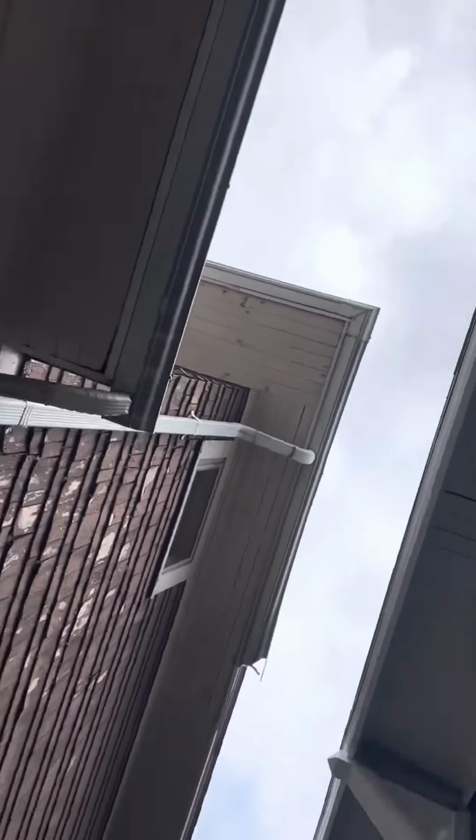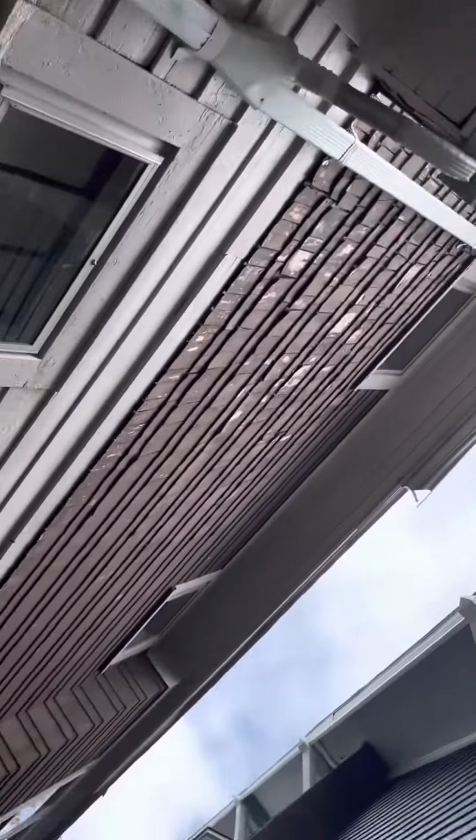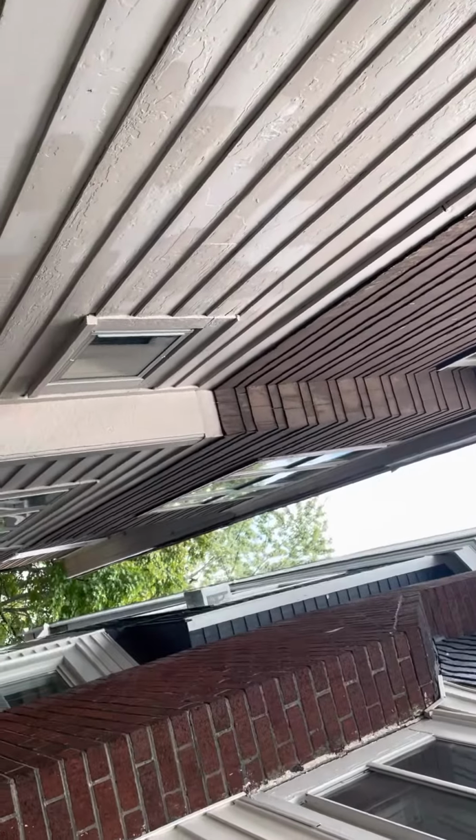Okay, and that gets bolted in, and then again, we'll come back and staple it to the sidewall so it can't wag. And then on the front of the house, you're going to come down from the soffit 4 foot, come out right on the side, on the front of the side angle, about 3 foot on the front wall. So you're gonna be 7 foot long. You're gonna go 4 foot past, and then come down at an angle, just like that, and then this is gonna be 16 foot. So you got a 16 footer here, 16 footer there, and a 24 footer there.